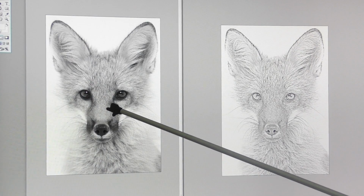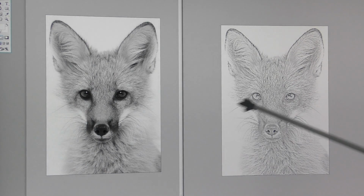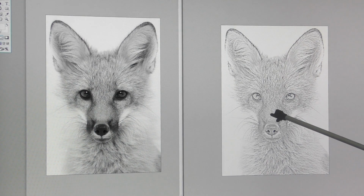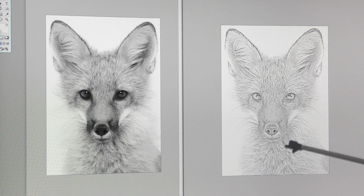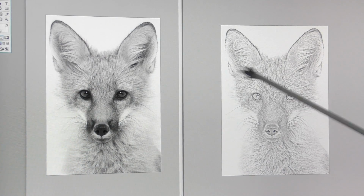Photo replication, one dot equals one pixel. Here, one pixel still exists on this screen, but you're going to make one pixel into maybe two or three dots size. So you don't need any knowledge of your laser machine. You just put dots down, whatever they are. And you adjust your picture so that you get approximately as close as you can back to the correct ratio of black to white in your image. And that's why you'll hear me only using the word photo replication. I do not subscribe to this principle of messing around with the image to make it good.